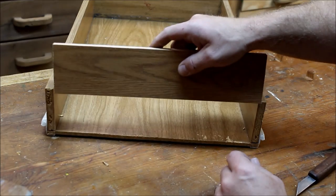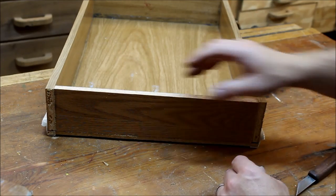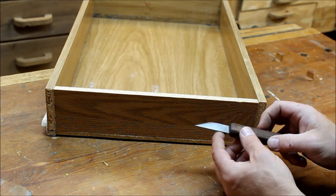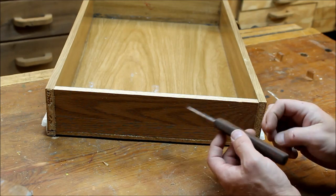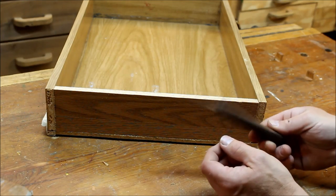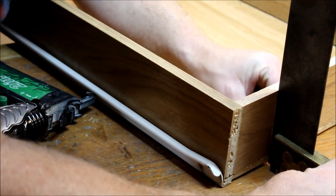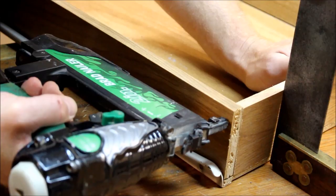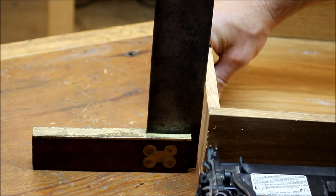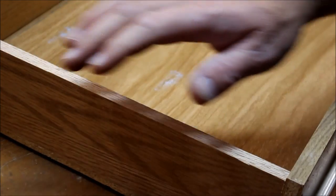Let's see how we did with the fit. There we go — no gaps on the side, looks good. The marking knife is definitely a lot more accurate. I made this one out of an old Sawzall blade, and a while ago I made a video on that — I'll put a link there if you're interested. That has definitely come in handy for things like this. So I'm going to check and make sure I have it nice and square and flush with the front. There we go — nice and strong, and I'm ready for the front.